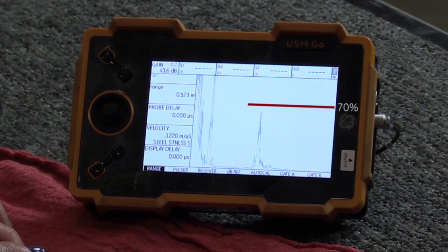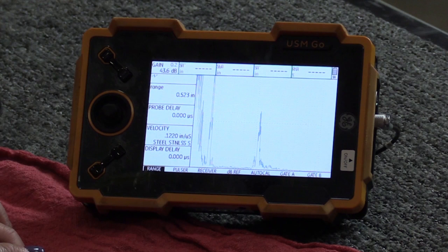If the amplitude from the EDM notch has decreased and is below 70%, the system must be recalibrated and all hardware inspected since the last acceptable calibration must be re-inspected. If the notch response has increased and is above 90%, the system must be recalibrated prior to inspection of additional hardware and any rejected hardware must be re-inspected.